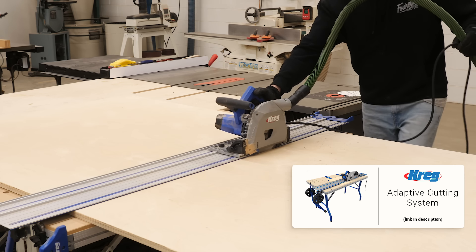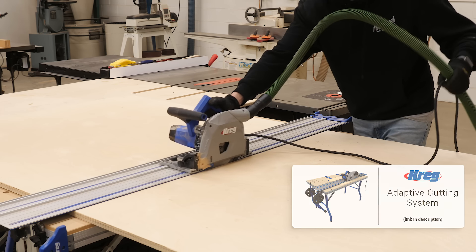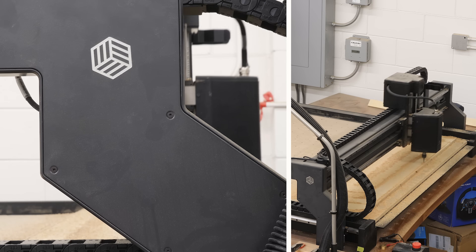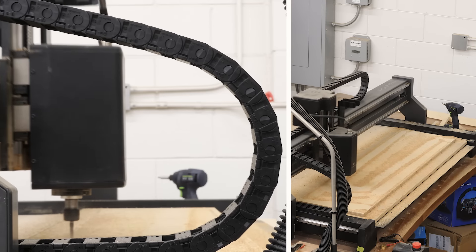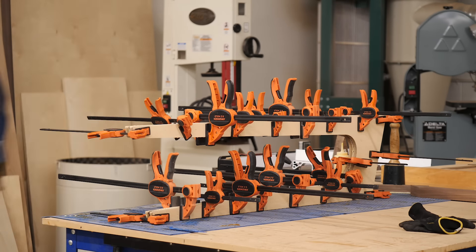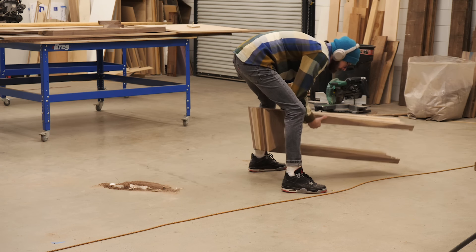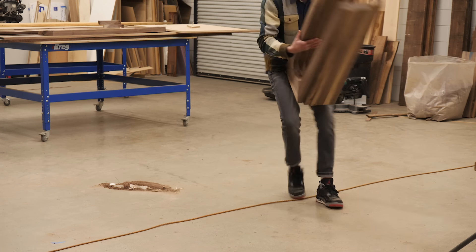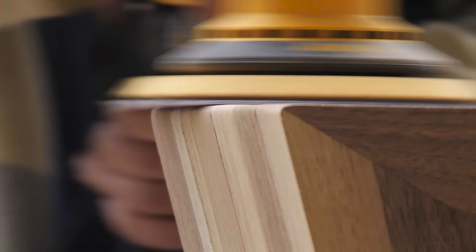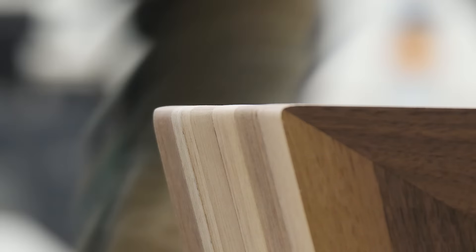Rather than using the same workflow for the plywood slat, I just cut a chunk of plywood and routed out the entire shape on the X-Carve — actually two of the entire shape — so I could laminate them together and end up with a sixth slat matching the inch-and-a-half thickness of the other pieces. Now that I have all six pieces, I'll line them up, clamp them together, and do some aggressive sanding to put the small curves onto the back edges and tips of the slats. Then we can get to work on what was by far the hardest part of this build: figuring out how to assemble everything.